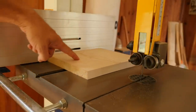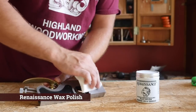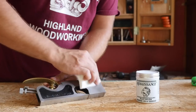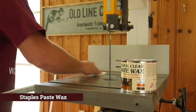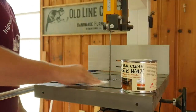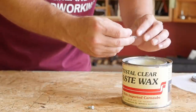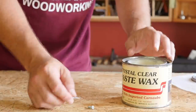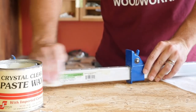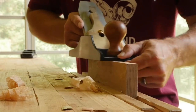Paste wax does wear off with friction and will need to be reapplied. Renaissance wax is a conservator's grade, museum quality wax that is acid free. It's the go-to choice for fine woodworking hand tools when you want a wax coating on your hand tool surfaces. The more budget-friendly Staples paste wax is great to have on hand for large cast iron surfaces like your table saw or other large machines in your shop where you might not want to use the more expensive Renaissance wax. I personally use this for pretty much everything — from rust prevention, to lubricating screws for hardware, to coating my clamps to keep the glue from sticking to them. I generally have a can within reach of the bench at all times.